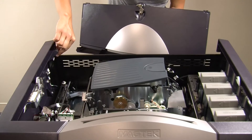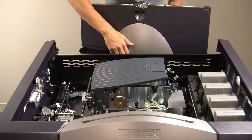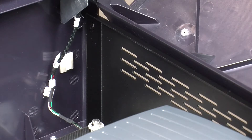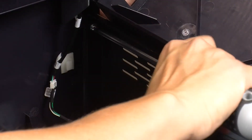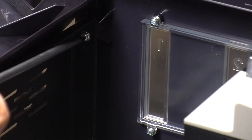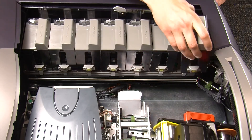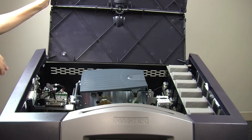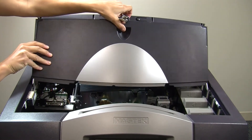Set the bushings into the circular hinges on either side of the front cover. Insert the top cover into the hinges one side at a time. While holding the top cover in place, reinsert the screws on either side of the front cover so that it's secured against the back wall. Reinsert the seven card hoppers. Slide the top cover so that it's almost halfway back, and gently insert one side at a time into the top of the front cover so that it can slide all the way closed.